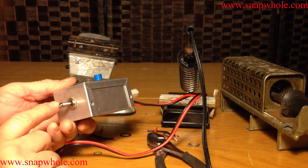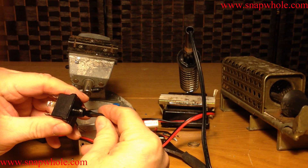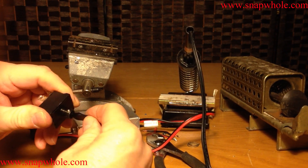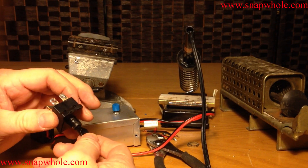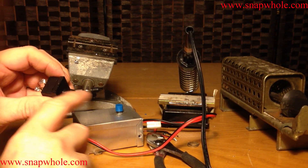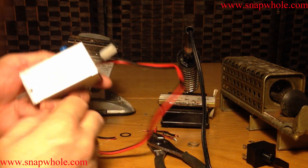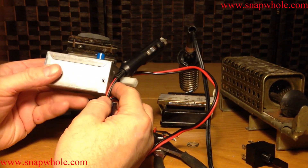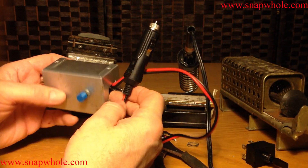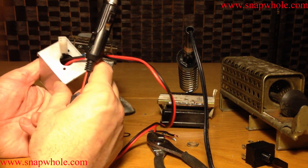This switch I got at a ham fest for about $2 — it's metal and feels very nice, I think it'll last a lot longer. This switch I got at Radio Shack for about $15 — it's the same type, center-off, up/down, double pole double throw, but it's plastic and cheap. I do like this one's blade handle; it makes it a little easier to use. I'm going to go ahead and make another one as a spare, but this is what I'll use as my main antenna controller. It doesn't have lights, but that wasn't a requirement — I just needed something that worked. If you liked the video, subscribe to my channel and hit like. Thanks for watching.